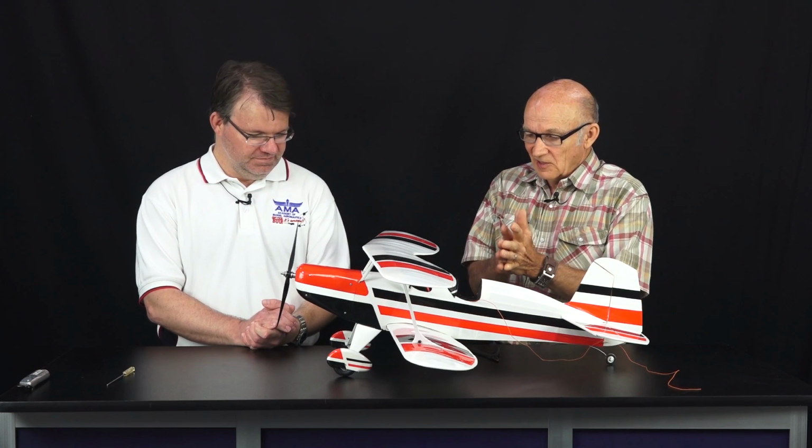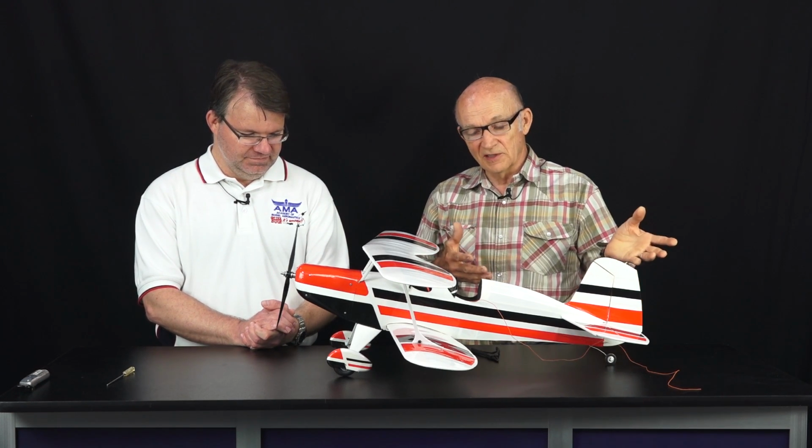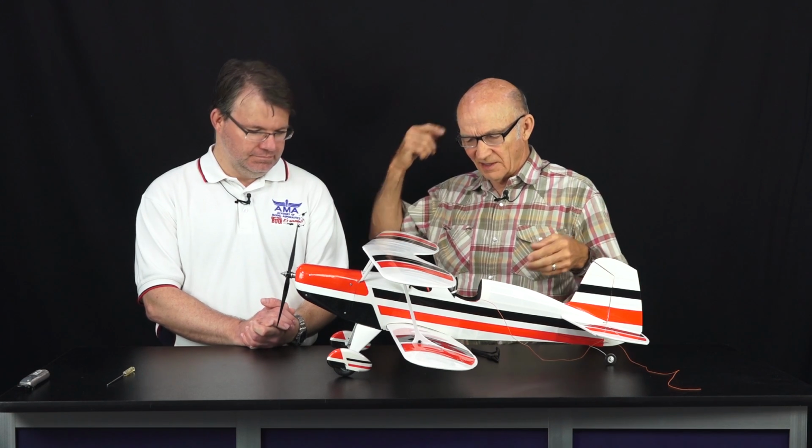Is there any other information or tips that you'd like to share with our viewers about either building it or flying it or the project overall? Well, actually, I used Coverite Microlite film on this. It's nasty stuff to work with because you get it together and it wants to stick to itself. They recommend you put talcum powder on it, but something in my head says it ain't going to stick as good if I do that.